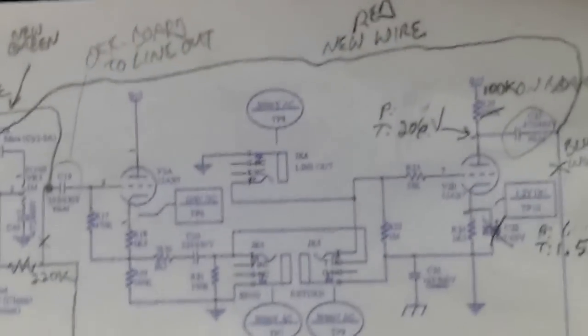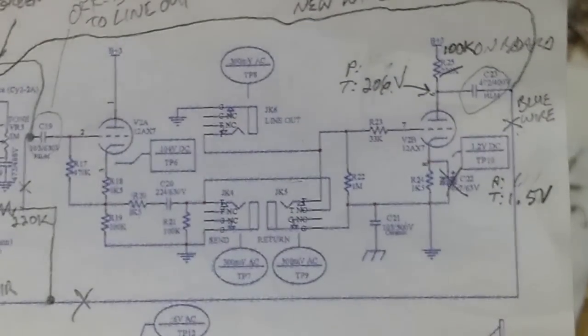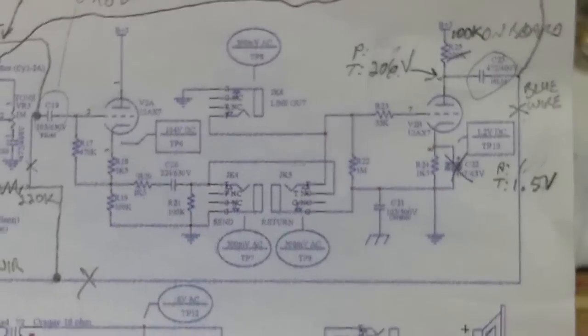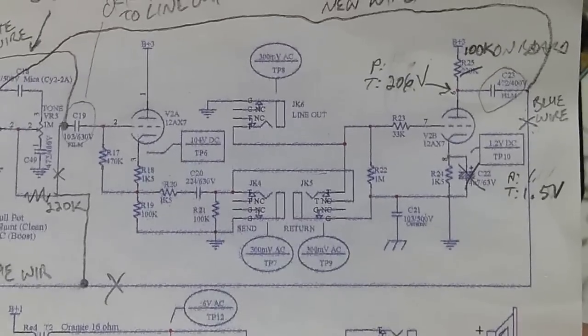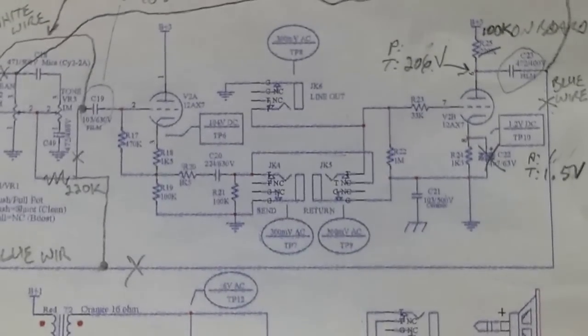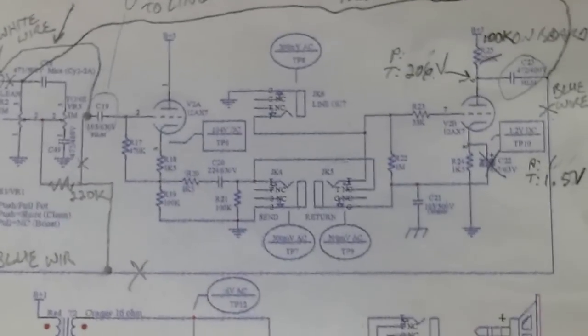Looking back at the schematic, the input max of 1.5 volts and the 300 millivolt AC in the effects loop looked like the perfect location. The signal is much higher in some places but then it gets loaded down by the tone stack and the cathode follower. I wanted it as far downstream in the preamp as possible but before my new master volume location, which feeds directly into the 6V6 tube. The idea is that when you control the reverb volume, it's not adversely impacted by the master volume — you want everything increasing at the same rate. You definitely don't want reverb after a master volume. Blues Juniors did that for a number of years and that was kind of a problem. Anyhow, that's it — hope you like it, bye.